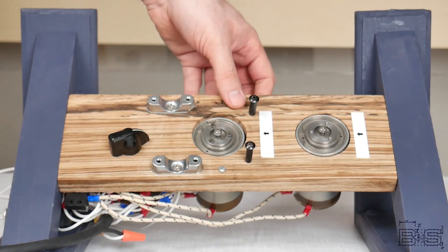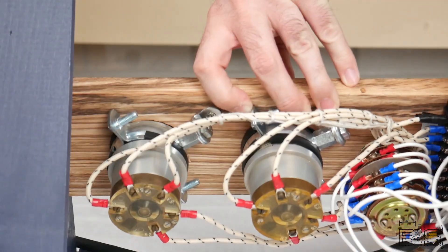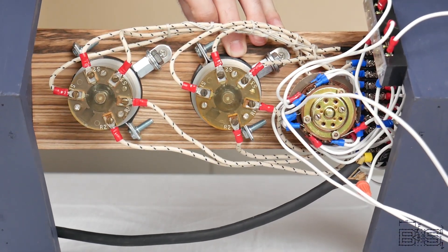There's no difference between a one speed and a 36 speed synchro — it's just how they're geared on the generator end. The idea is that for every 10 degrees of the 360 degree dial, the 36 speed will spin a full revolution. And if our response dials are geared the same way, we can increase our accuracy tenfold. I get the impression the Navy went on a synchro buying frenzy in the 50s and 60s. You can find them all over the internet and I almost guarantee every single one of them still works. For my setup, I'm using regular 115 volts AC for excitation and run it to all the rotors in parallel. It's important that all the rotors use the exact same power source, otherwise they'll never synchronize. Please consider donating to a battleship museum like the Battleship Missouri — there's a link in the description to the USS Missouri Memorial Association website.